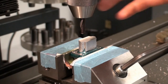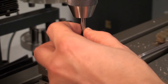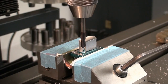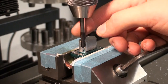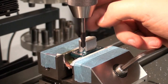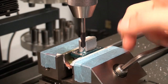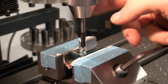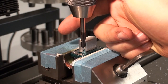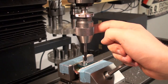And yeah. When I use the normal drill in this chuck, you see that it overhangs a whole lot, and this is against the purpose of this type of drill. This drill needs to be short and stiff to give a precise position of your hole, and when it's reaching out that long, it tends to walk around. This is not a problem when you use a big drill chuck or a collet chuck or a weld-on tool holder, end mill holder or something like that, but with a small drill chuck like I use, it makes all the difference.